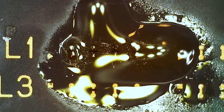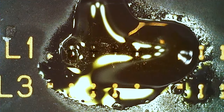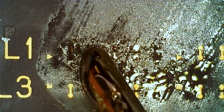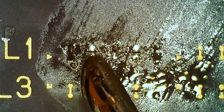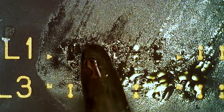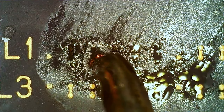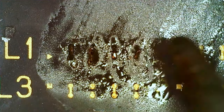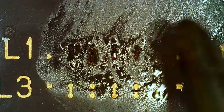I think we have all of them now, so I'm actually gonna remove some flux here, because I don't want a ton of flux when I'm trying to join them. I find it easy to do it without a lot of flux, because you intentionally want to make a bridge. So initially we don't care too much about getting the most beautiful solid blobs here.